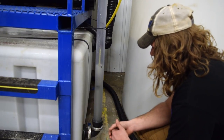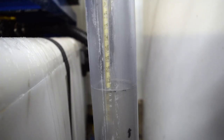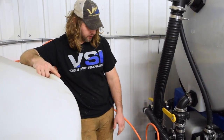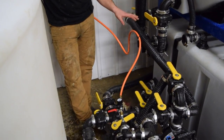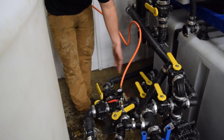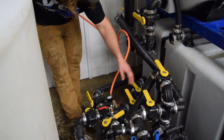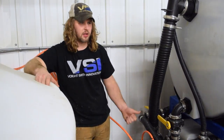We're floating around 21% at the moment. After about five and a half minutes, we're at 23%, so we're going to go over and switch our valves around to pump directly from the brine maker to our storage tank. As a standard on all our units, one pump can make its own brine and pump to storage tanks. You'll want to make sure your agitation valve is closed, your suction valve on the tank is open so we can pump out the bottom tank, and the pressure side of the pump feeds through the manifold. This valve goes to our storage tank, so we isolate the suction and pressure sides and feed directly to the storage tank.